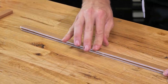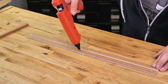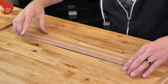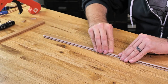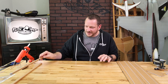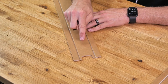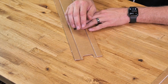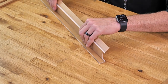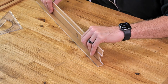We'll do a practice fold and make sure we're happy with the way everything fits. A proper A-fold is where the side plates are above the bottom or top plate of your fold. To do a proper A-fold, we're going to keep the side plates firmly against the table and rotate the bottom or top plate up 90 degrees. It's really handy to also have a triangle square just to make sure we keep everything nice and perpendicular. So we're going to do a quick practice fold.